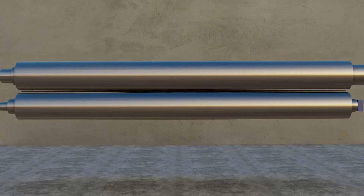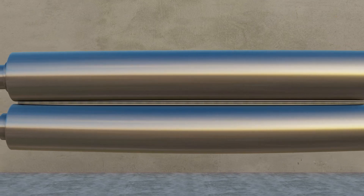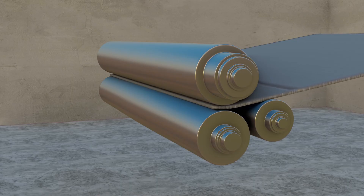When working high in the capacity of the machine, the force required to bend the plate is much greater and the rolls are deflected past straight. You end up pinching tight on the ends and loose in the center. In this case the ends will roll tight and the center rolls open, leaving you with a barrel defect.